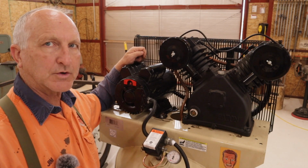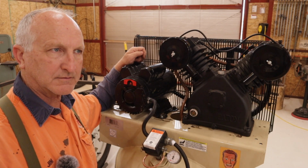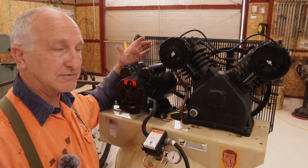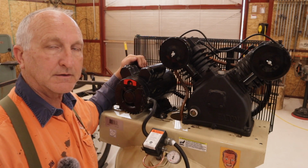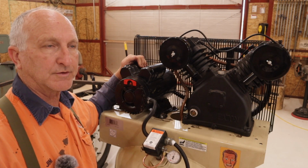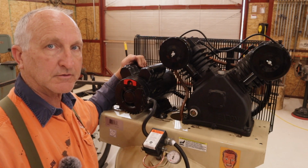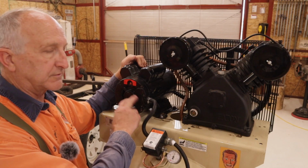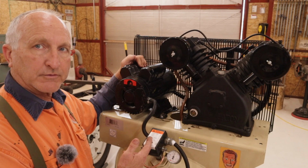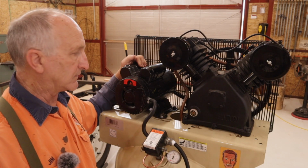And you need a 2 3/4 inch pulley because of the RPM. The faster you spin it, the more horsepower it takes. Well, based on the information I had, this is a $35 pulley, and it's a 3-inch pulley. Doesn't seem like much, but it's the difference between 770 RPM and low 700s RPM, and that makes a big difference to the motor on load. So, am I overloading this motor? The breaker's not going to trip because that's a 50 amp circuit I've got going into this.